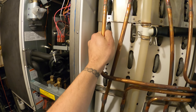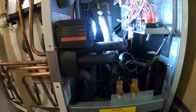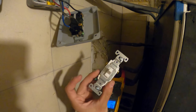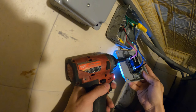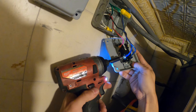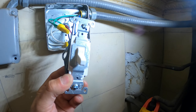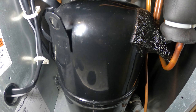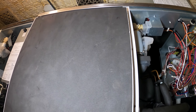It's getting hot - this is a hot gas defrost, so at first it's trying to melt the ice that was there. That's insane. We need to change that switch. I found the breaker - let's double check to confirm: zero volts. I got a new two-pole switch - let's go ahead and swap this out. Alright, the new switch is in, taped it up. Let's close this up and turn the unit on. That's it guys - you can hear the compressor running. That's a beautiful thing. Let's give this thing some time - we're going to go to lunch and see if we drop ice.